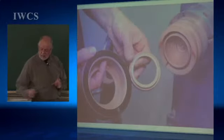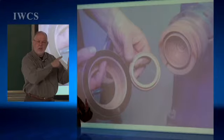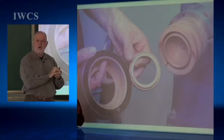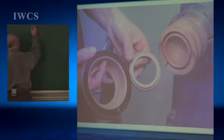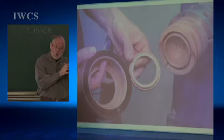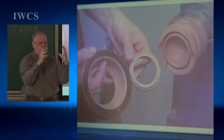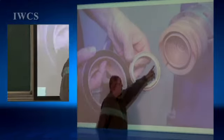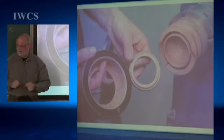Then this thing here, remember back the ancient Chinese turner, he was turning the bowl. He has another piece of wood and he cuts a hole in the wood, then he pushes the bowl inside and it holds it. It's called a chuck. C-H-U-C-K. A chuck is very important for holding the wood. You can hold it between 2 points, like the man you saw, or you hold it by pushing in a hole. And this is his chuck. He made it. So the ball goes in here. You hold it with this piece, and this screws on to hold it.